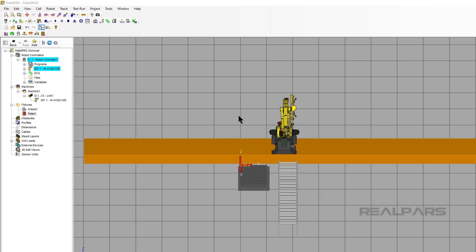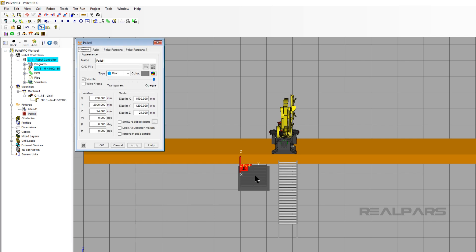We will set up a cell that will use six infeed stations and six pallet and infeed stations. They will all be placed apart so that if the robot were stationary, it could not reach each position. You would want to do this scenario in real life only if you had a situation with high mix, low volume — meaning you have a variety of products which run slow. Let's move Pallet Station 1 all the way to the left to make it easier to identify each pallet and infeed station.